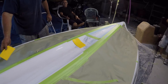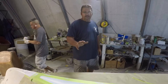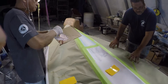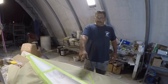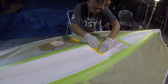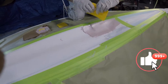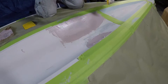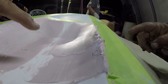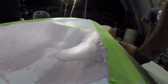We do the straight edges with that, and that's our main tool to do our radiuses. For these radiuses we're using the P77 instead of the All Fair — only because these are little areas and it dries quicker, so we can work faster. Tomorrow we want to paint this middle part, that's why we put paper to protect our edges. You're going to watch Calito use that template he just made. He puts enough material, and once there's enough material, watch — he puts very little pressure.